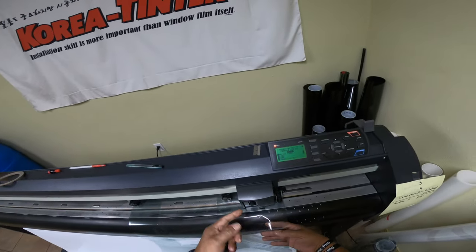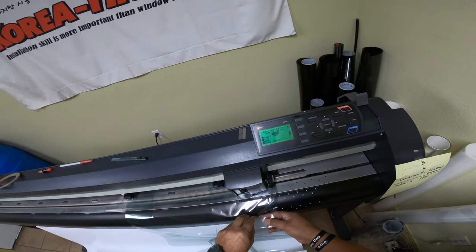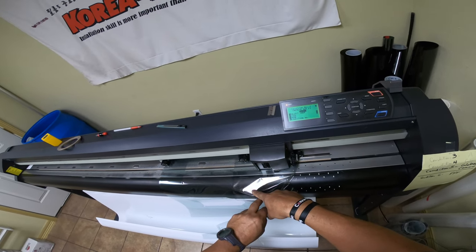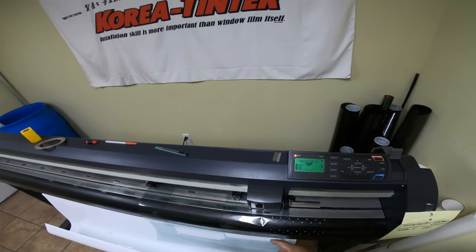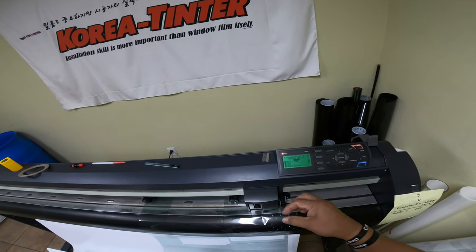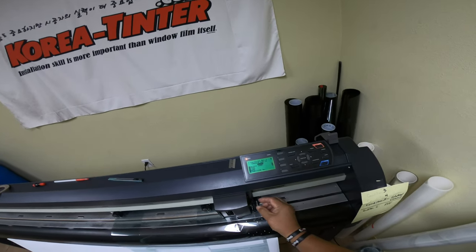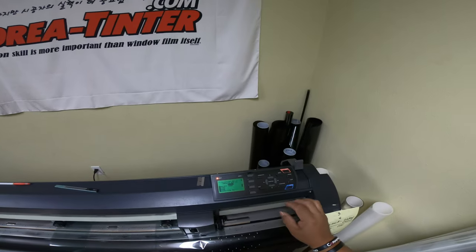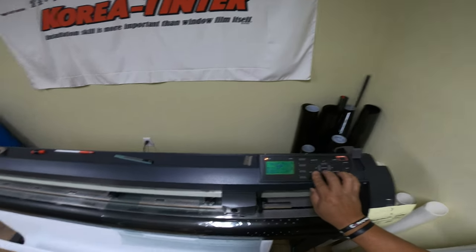Both cuts are stress-free. Now I remove the film momentarily to examine the liner — I can see it's barely scoring. I need it to go a bit more into the liner. I don't want to reset this for at least a year, so I need to be at about 50–60% into the liner. One smidge to the right — 1/64 — and I make the cut.